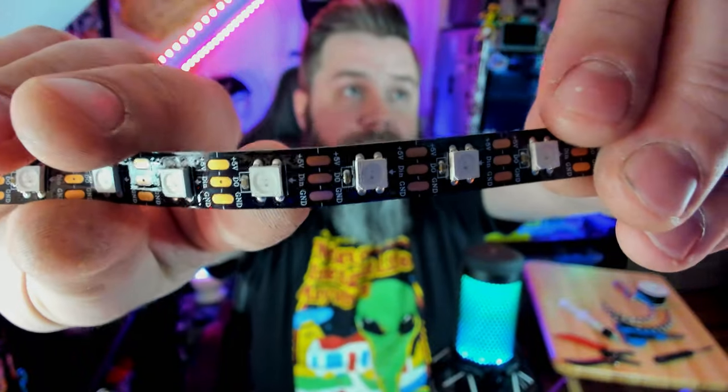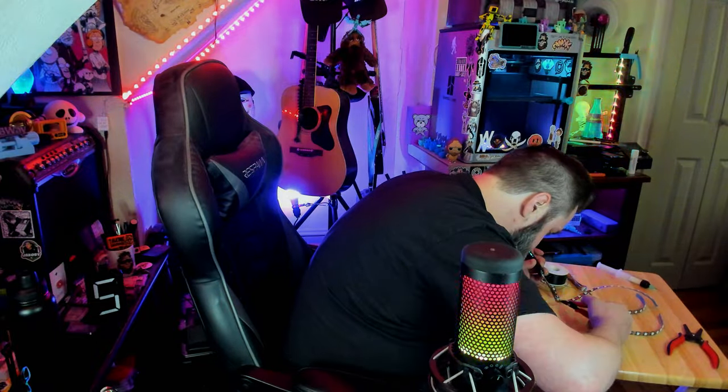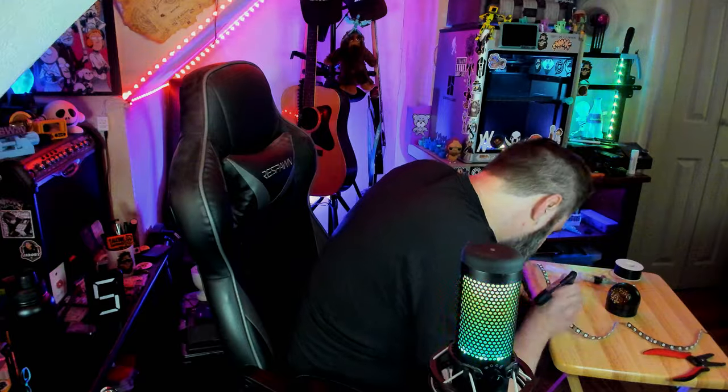So I guess there's nowhere to go from here but to start actually adding the lights to the printer. Let's do a little bit of a montage — and that calls for the TV tray of science. We've got some flux, wire, NeoPixels, solder, and a wire stripper. And my trusty TS1C — let's get at it. One thing to note about NeoPixels is that they do have a direction on them. If you look super close, you can see the arrow right next to the NeoPixel — that arrow tells you which direction to run them. So you've got four strips together — all I have to do is solder the input wires to this and we're ready to install it.